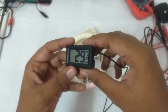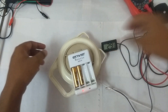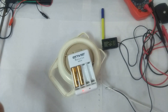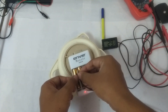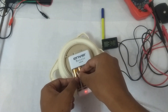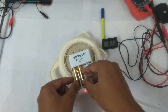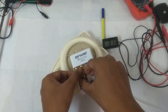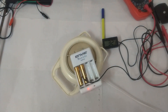For added safety I'm going to use this digital thermometer. I'll put the temperature probe in between the batteries so we can monitor the battery temperature. The current ambient temperature is about 31 degrees Celsius, and I will stop charging when the temperature goes above 40 degrees Celsius.